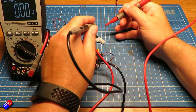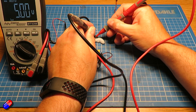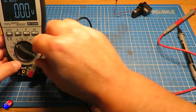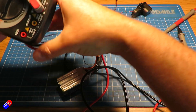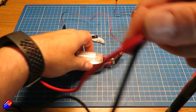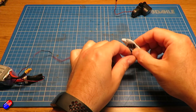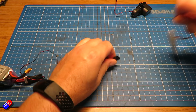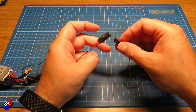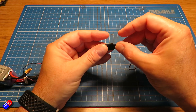The only extra thing I've done is double-check with a voltmeter that it's outputting exactly five volts — which it is — which means I can plug the P-NUT Pro in and away it goes. Now I can plug this balance tap into a 4S battery on the quad I'm testing with, and just wrap up the spare cable and pop it under the battery strap with everything else. It also means this could be used in fixed wings and all the other models I've got, because I've made it long enough to be able to do that.